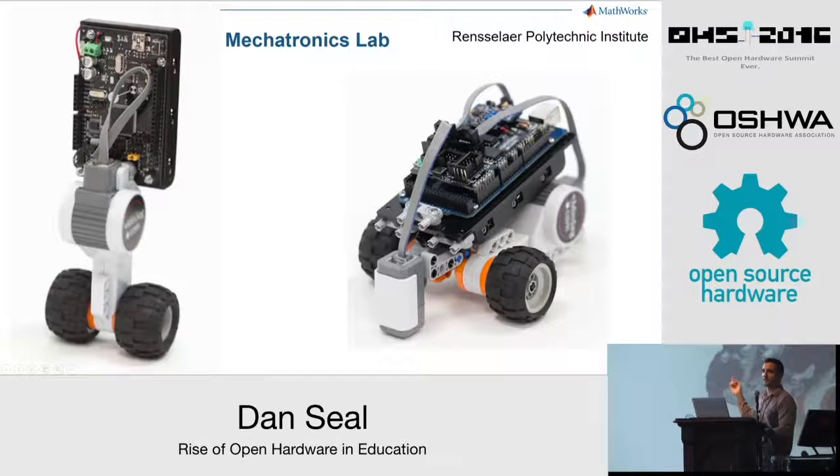This is the kit that he uses — it's a min-seg kit, and it uses an Arduino with an added Bluetooth module, a Lego motor, and a battery pack. It uses a control algorithm developed in Simulink's block diagram interface, so students can focus on just applying the theory rather than debugging in C. As with the BITalino device shown earlier, this kit builds off the Arduino platform to create an application-specific hardware device.